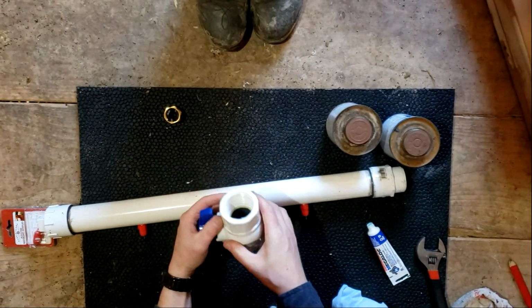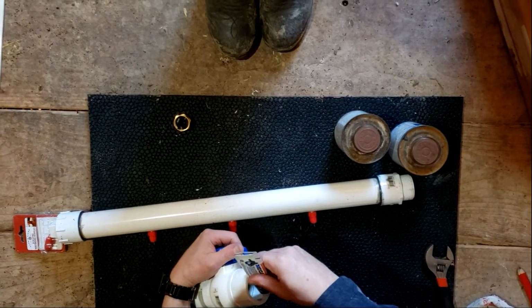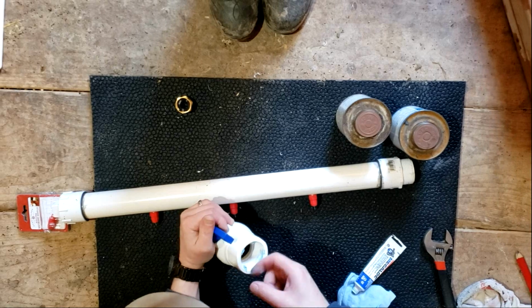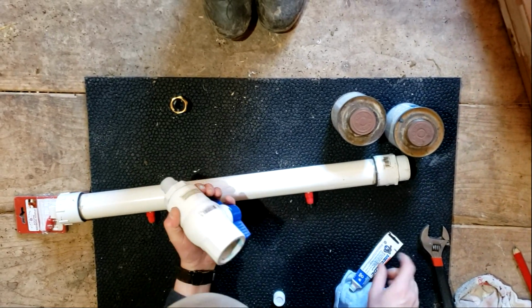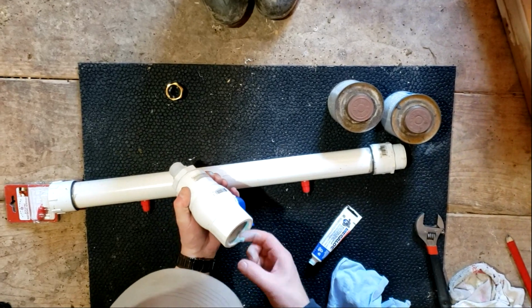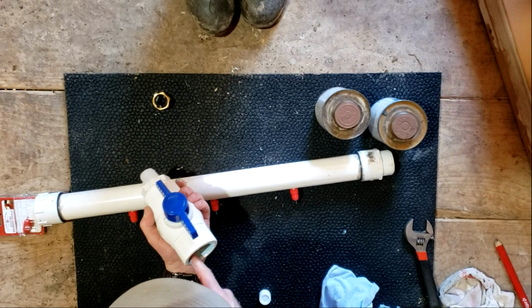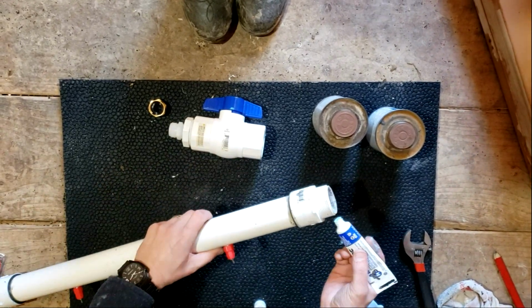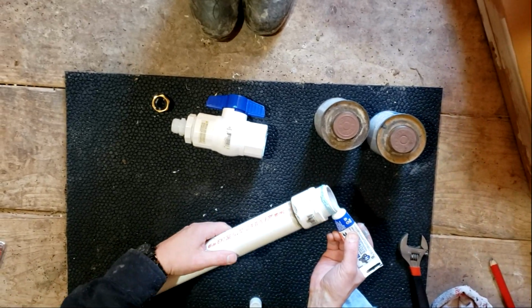And I'll open this valve just a tiny bit so water can basically trickle in as needed. And again, I'm threading all this. You can certainly slip all these and glue this whole thing together, folks. I just learned over time that sometimes I like to take things apart. And once you PVC glue things together, what a pain in the butt that is. So I do like threading on these kind of parts. It costs a little more to get threaded, but I think it's worth it.